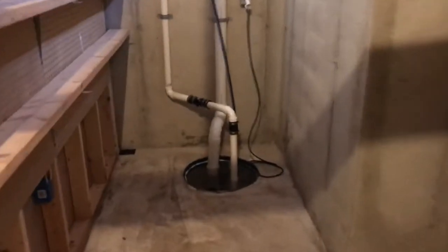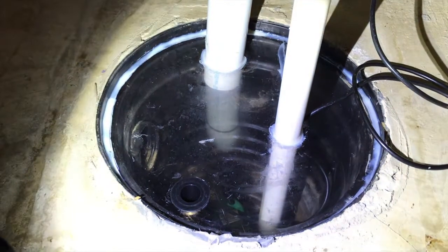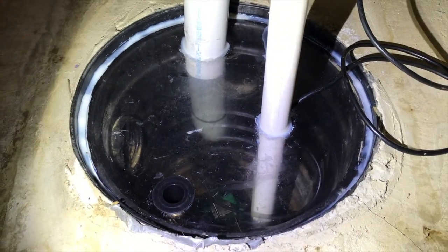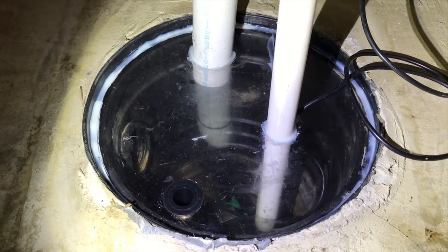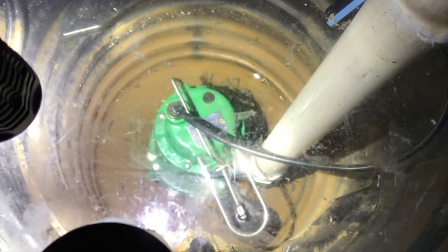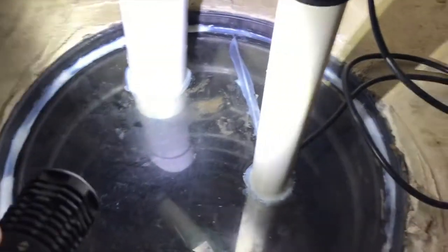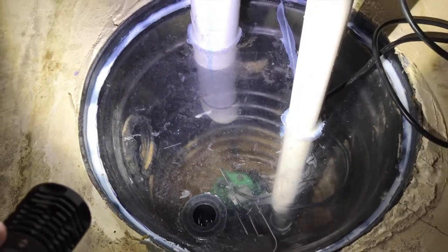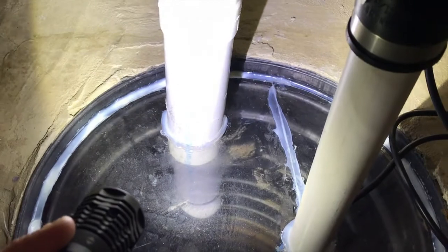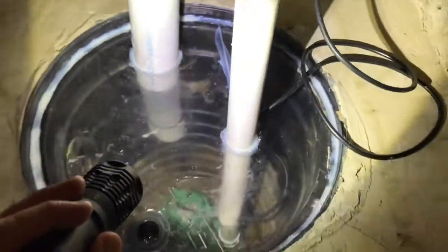The passive system has been converted to an active system. Let's start with the actual cap. Take a look — before, remember, it was black and solid, you could not see through it. What they did during the conversion was cut that black solid cap off. I went ahead and requested a brand new sump pump to be installed. This cap is sealed — all around is a bead of silicone creating that airtight seal, not allowing any radon gas to escape from that cap. Around the radon pipe it is siliconed, and around the sump pump pipe it is siliconed, as well as the cuts they had to make to position the cap in place.